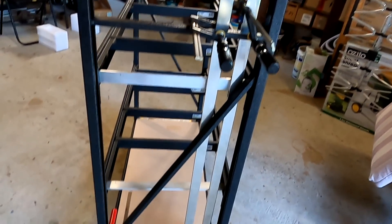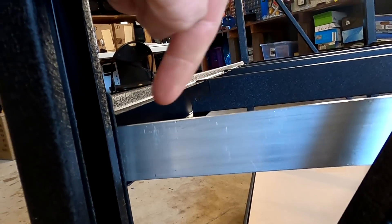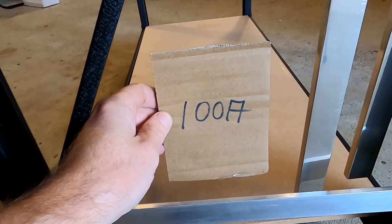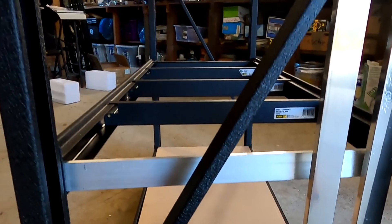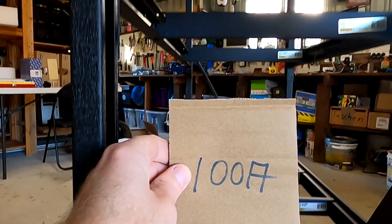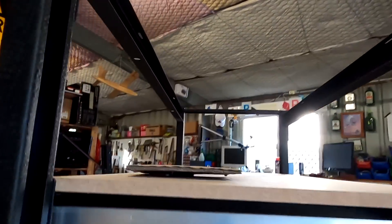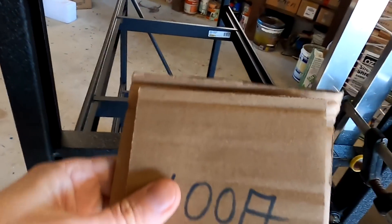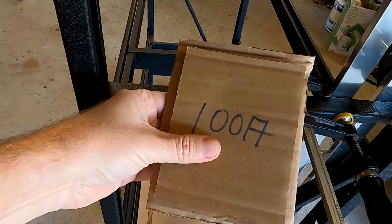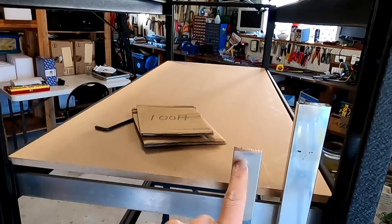So that's the design I came up with. I'll have these aluminum supports directly under the shelf — they fit perfectly inside, just need to drill a hole for the Allen key. The circuit breaker for the bottom shelf goes in here, and all the other ones will be further this way. This one will have a bit of an offset; otherwise it won't fit because of the beam. So there will be one here, one here, and the big one at the top. The 250-amp breaker is actually slightly bigger than the 100-amp breakers. Positive here and negative on this side — this one is 60 mm shorter, for a reason.